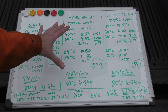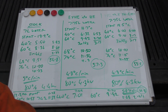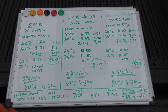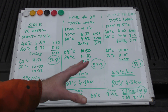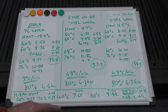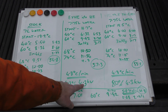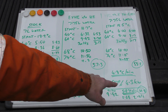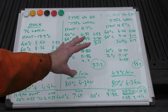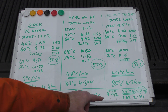The second column: I went from the exhaust heat exchanger into the heat exchanger on the heater — coming out of the tank, through the exhaust heat exchanger, and then into the heat exchanger itself. It doesn't really matter which way around I did it, because I got the exact same results — almost exactly the same. Going one way I got 4.3 kilowatts, and going the other way I also got 4.3 kilowatts.